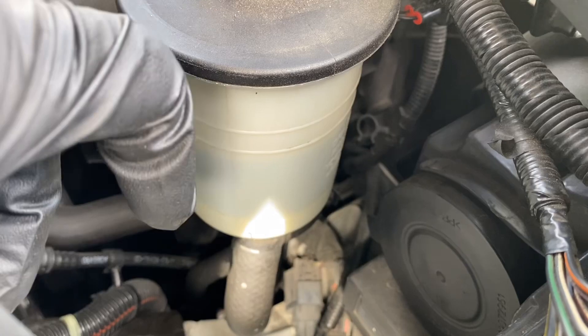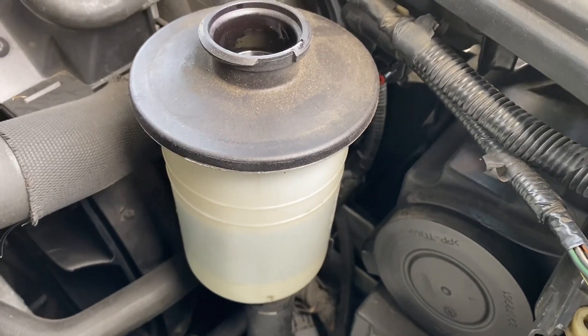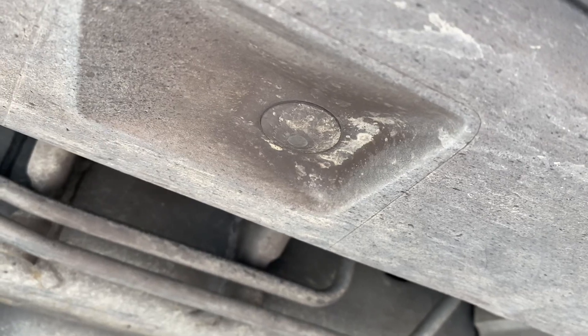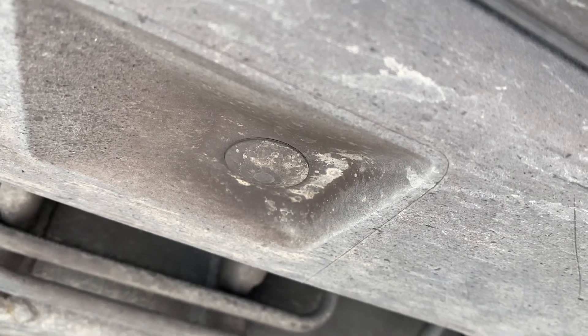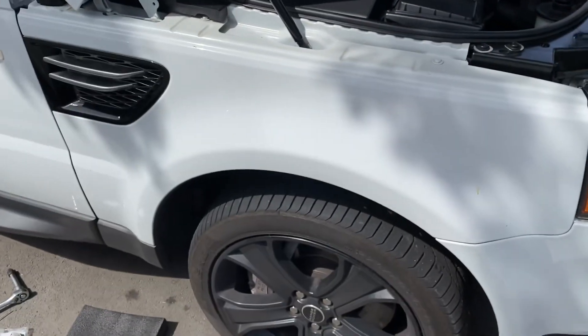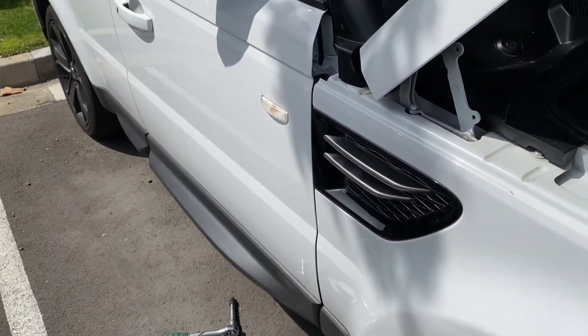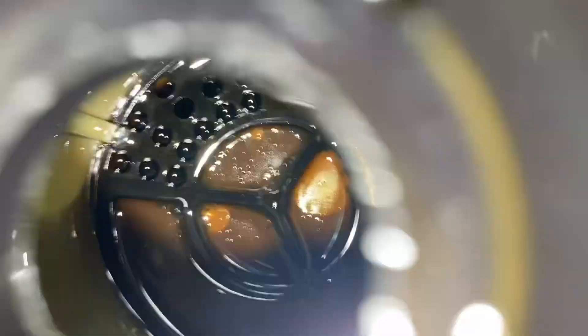There is not very much in this tank, and of course we're doing it proportionally. Today we're going to change only a small amount of fluid, and maybe another day we can change another small amount — in that way we will achieve cleaner hydraulic fluid. As the mechanic noted, replacing the filter here doesn't really affect the system because almost no air goes inside, but the system is designed so that all the hydraulic fluid circulates and even small bubbles should go out to the reservoir.